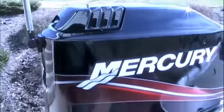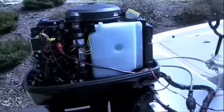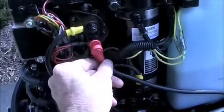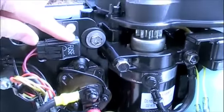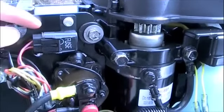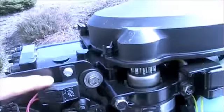It's a good idea to take the hood off the motor and check things in there. Here's your latch — just snap it down and lift it off. Once you get your hood removed, there are a few things to check. Check your starter wires, make sure they're tight. There's a big 20-amp fuse inside a little fuse holder right here. If you're ever on the lake and your motor doesn't start, the first thing to check is this fuse — just snap it loose and pull it out. If the fuse is blown, put another one in and you may be good to go. A lot of people don't know it's back there on the motor, but that fuse controls all your electrical stuff.